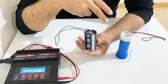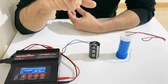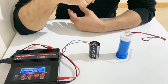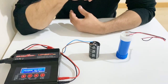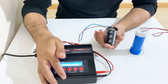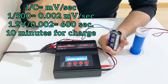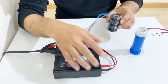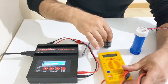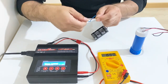To compare these two capacitors under the same conditions, I am going to charge both up to 1.2 volts. When charged to 1.2 volts, both capacitors will store the same amount of energy, making it a fair competition. First I'll charge the commercial supercapacitor — according to the formula, charging with one amp should take 10 minutes to reach 1.2 volts. Before charging, I'm going to show you the initial voltage of both supercapacitors using my multimeter. I've short-circuited both and set it to voltage mode.